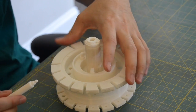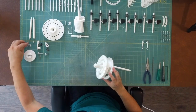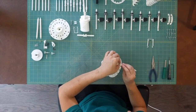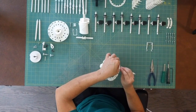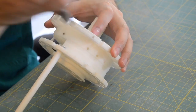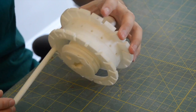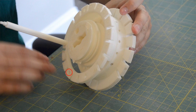Next, I connect the support columns. These are threaded using an M4 die. There are 4 holes the correct size along the bottom of the main casting, and there are 3 support columns. Use the holes not centered under the smaller group of cuts in the main casting. That hole is for the reversing lever. Secure the support columns with M4 nuts tightened lightly. Do not put a support column in the marked hole.